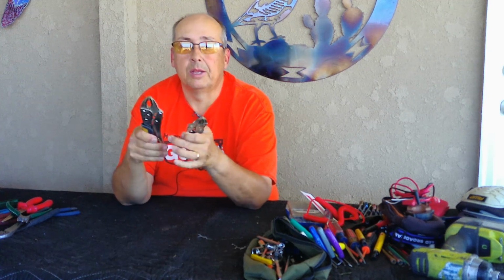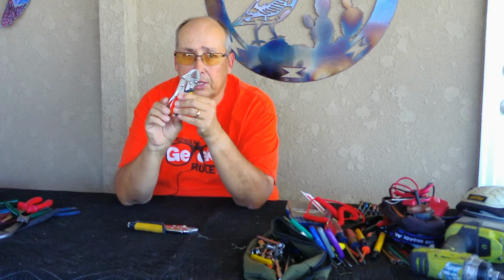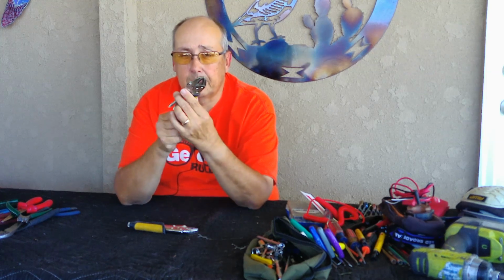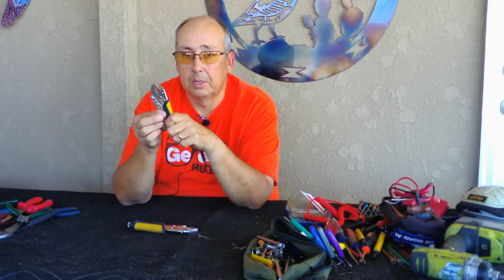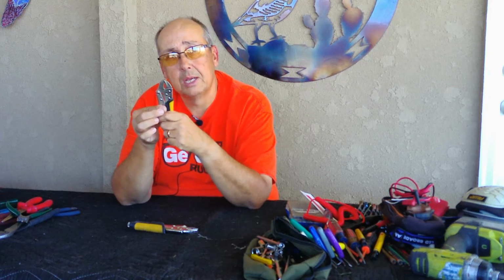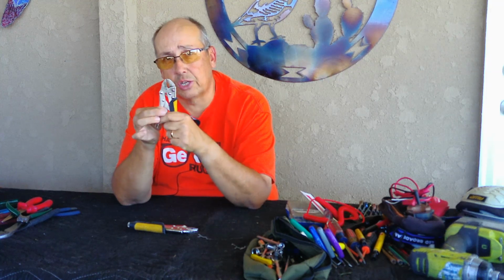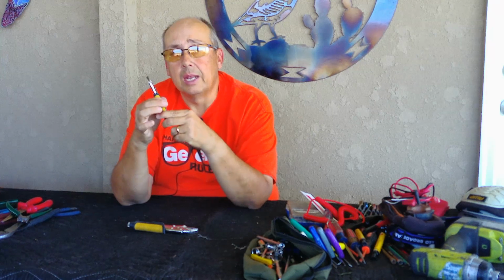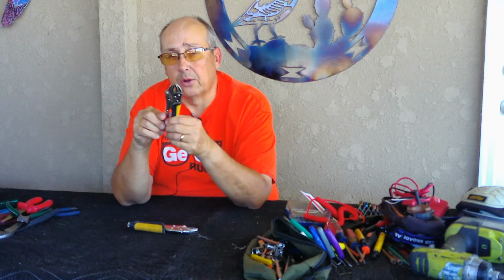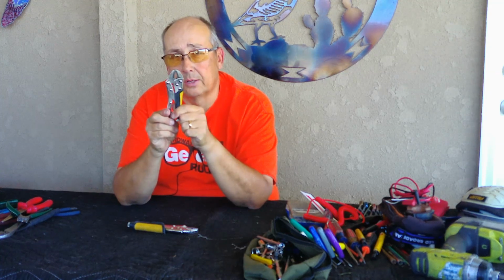This fly is bugging me here. The little tiny ones I use when I'm putting awnings on. And you might say, what are you talking about? Well, I have a contraption that I rigged up that involves a rope, a pulley, a way to attach the pulley to one of the vertical sections of an awning arm. So that makes it where one person can put an awning on without requiring assistance.